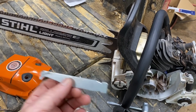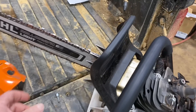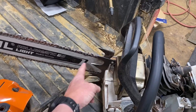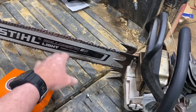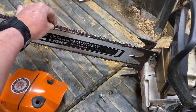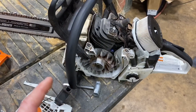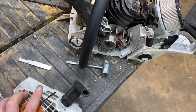I've got a lot of videos out that show saw maintenance and bars and stuff. Make sure when you pull that bar off that you clean the oil journals in the bar — that's the most important thing. Clean that rail out and then clean those journals out, because you can see it's got so much stuff in there the chain don't even want to sit down in there. But I put some hours on this saw the other day.